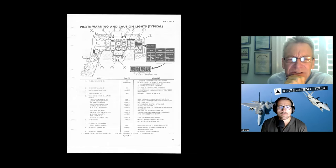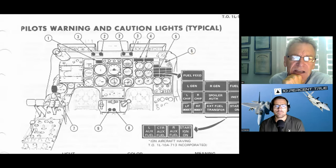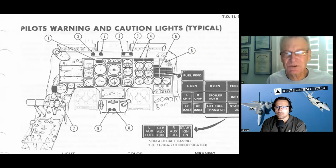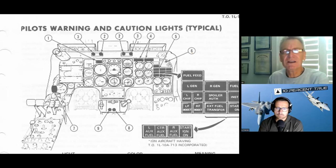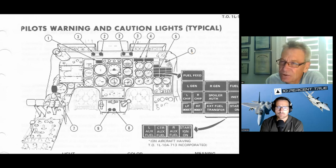Now we're going to go over warning lights. Standard red light in the gear handle if the gear wasn't down or if it thought you should have it down — so if you had flaps down and below a certain speed, or if the condition levers weren't in takeoff-and-land position. Already covered the over-torque and nacelle high-temperature lights, fire pull handle lights, and wheels warning light.